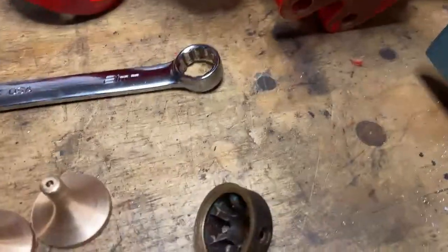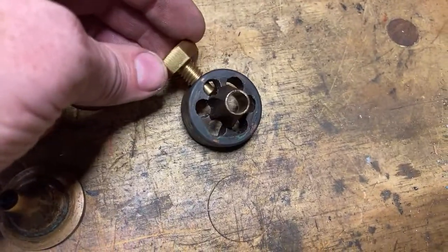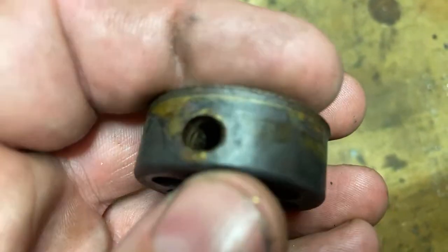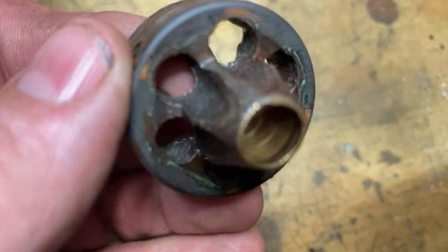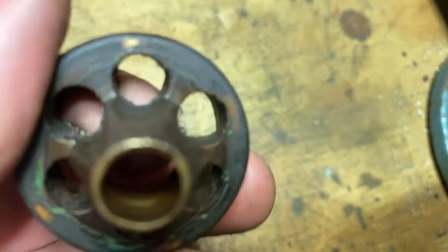Which actually works. It's supposed to go in the side here. Thanks, Peter. Thanks, Paul. Which is what locates it, see? So it's sort of critical to get this distance from here to there at the right place. And then we're going to make them a smooth push fit in there, like push in and push out fit, so I don't have to worry about a puller or anything. Hopefully they come out again. And then put a bit of water pump sealant or something around them.